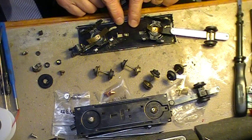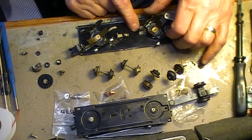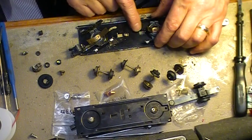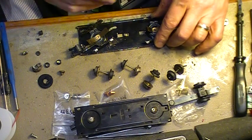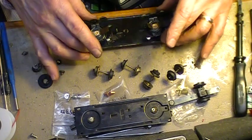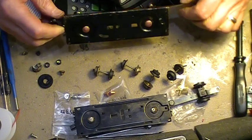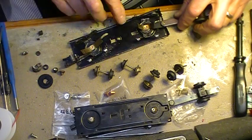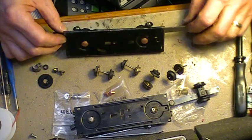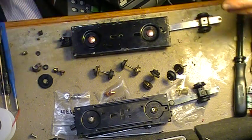There was a brass homemade washer soldered to the top to hold it in. The bushing, which is supposed to go all the way through, had just disintegrated. After spending an hour or two cleaning the metal chassis, I found one of the tangs had been bent flat. I tried to pry it up and bend it forward, but it just snapped off. So I threw up my hands and went back to the drawer, where I found an absolutely bare chassis with both stops intact and not too rusty.